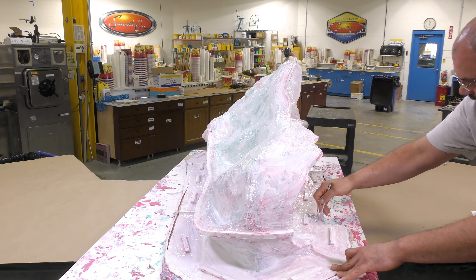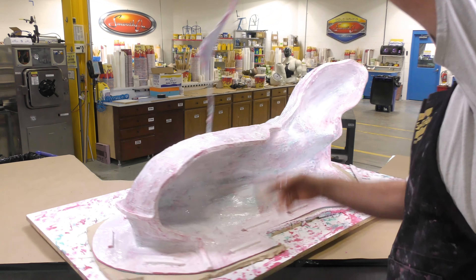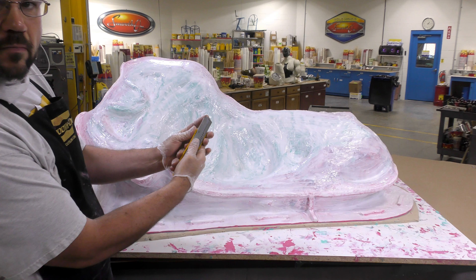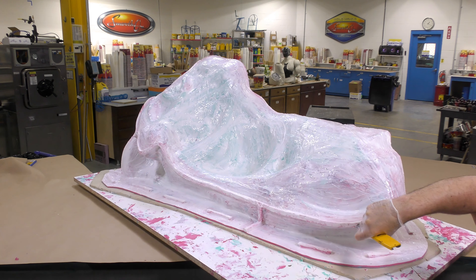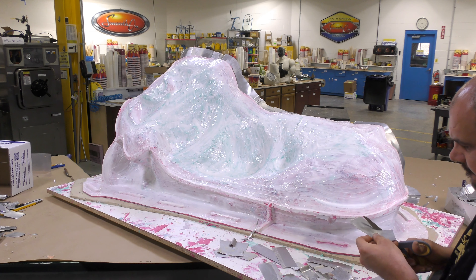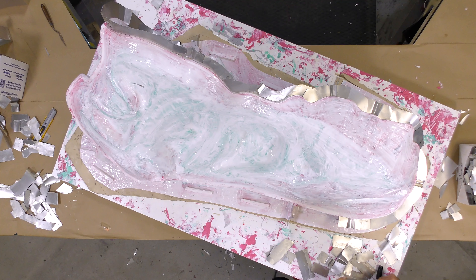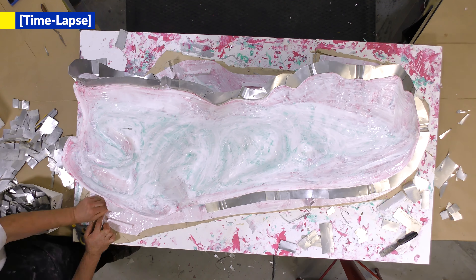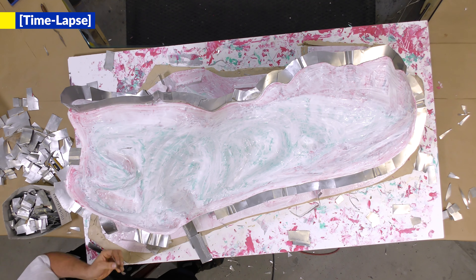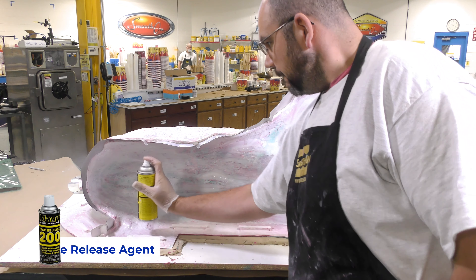It's now been 16 hours since we applied the last material to our mold. We're going to trim the extra rubber around the perimeter, creating a nice crisp edge — this prevents any tearing from the edges of our mold. Then we cut into the separation shim we built, only about 5 millimeters deep (about three-sixteenths of an inch), because we're going to insert aluminum shims into that cut. We're not cutting all the way through — only partially to insert the aluminum shims that will help us separate the different parts of the support shell. I like these aluminum shims because they can be repurposed for many support shells, and they're very thin and easy to work with. Once inserted, we apply release agent to the shims to make them easier to remove from the support shell.